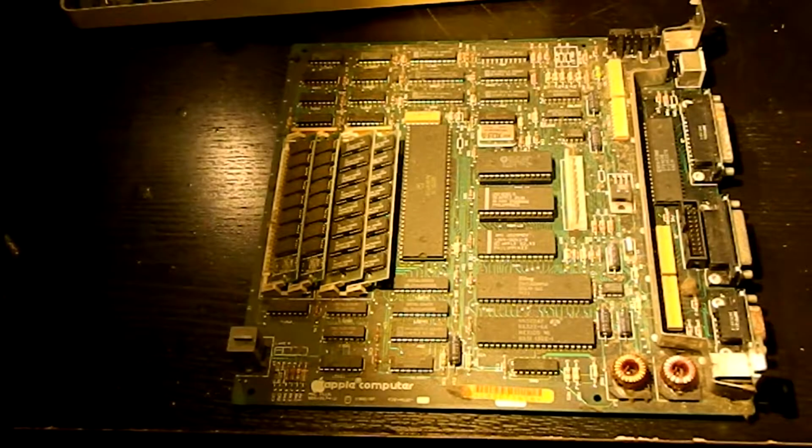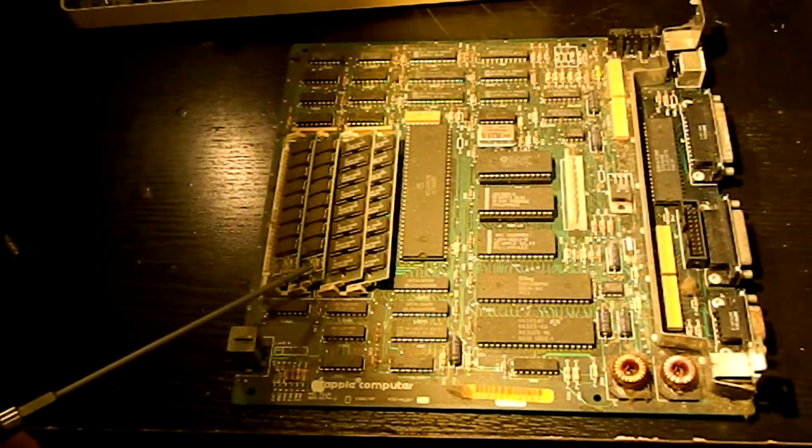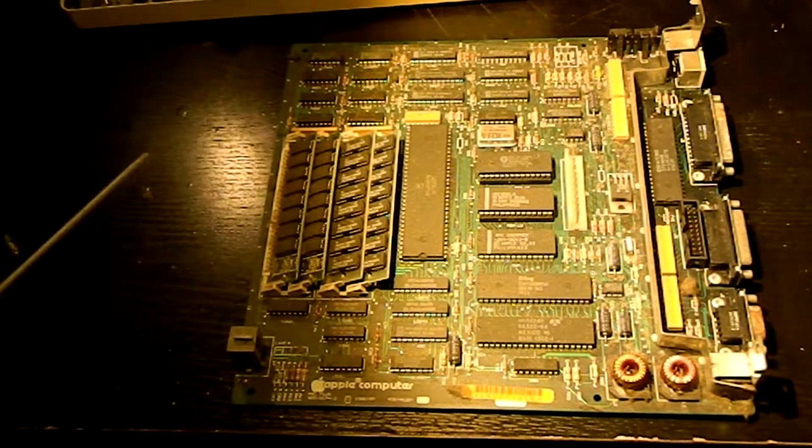and this is the main board in all its glory. As I had surmised from the earlier video, we had two flavors of SIMMs in here. We have two 1 meg and two 256K. I'm not sure which is which. I'm guessing these are the 1 meg ones. There were some special rules about what kind of RAM you could install. Because the 68000 had a 16-bit data bus, you had to install definitely same size in pairs, but there were also a lot of other special rules that a lot of Macs had about what type and in what combinations you could install RAM, even over and above the basic RAM on the bus has to match high and low bytes. And also the other reason that I think these are the 1 meg ones is that they have space for a parity chip, which is a newer thing, and the chips themselves are physically smaller, but I could be wrong.